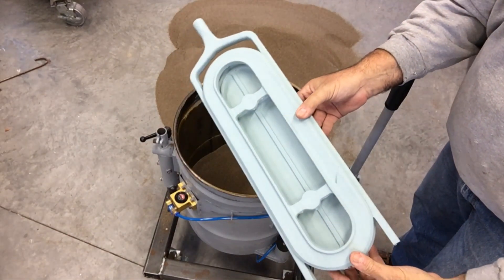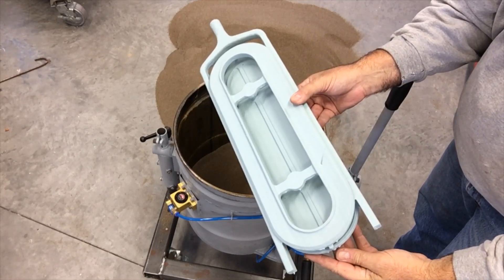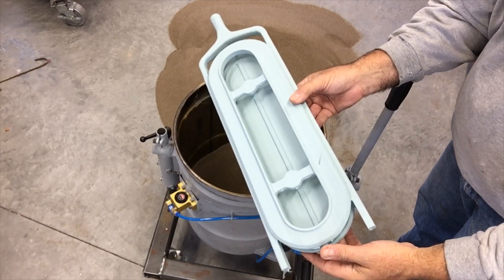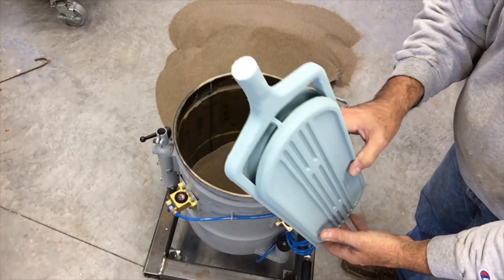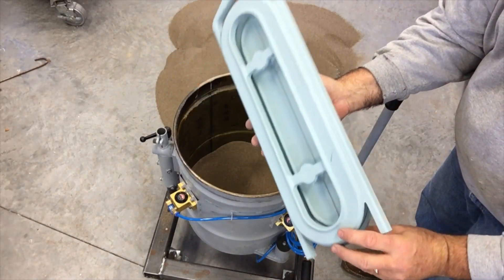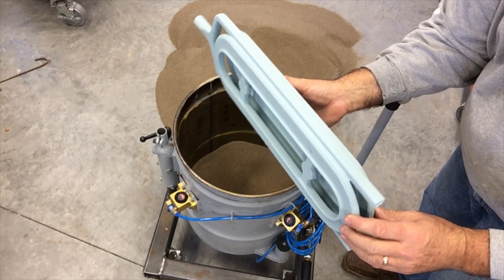We'll start off — I've got a few of these patterns here, they've been machined from extruded polystyrene board. Cut just with woodworking tools and a router and assembled into this pattern with this type of gate and sprue configuration. They're done in halves because it helps keep flimsy patterns like this straight when you pack them in the mold.